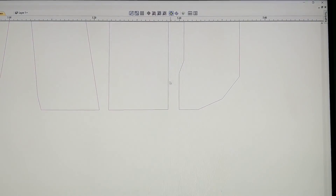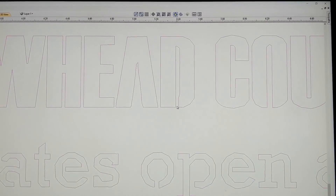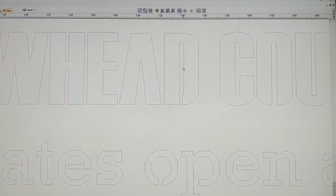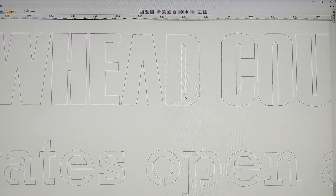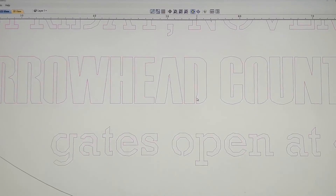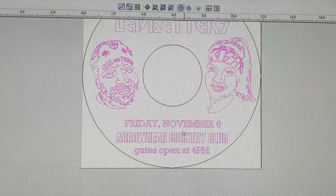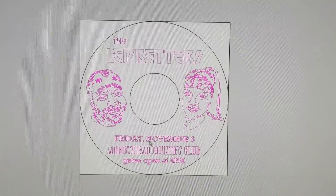You can see the bottom of this D — I've basically cut a channel out through the bottom. This way it still looks like a D, but that center piece is retained. Normally that would be pretty hard to cut with a scroll saw without it bending and getting deformed. But with the laser this works really well, because it doesn't disturb anything mechanically since it's cutting with light and just burning it away. This kind of detail works very well with the laser.